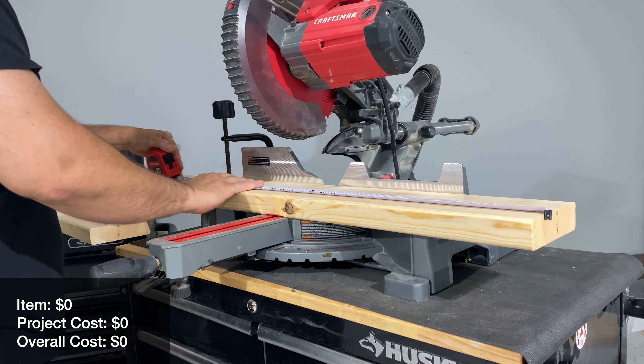To do this, you can just stack your two boards up, make sure they're lined up on the opposite end, and then line the shorter board up with the saw blade before you start cutting. This will put you in a position to remove any of the excess. After you've made all your cuts, you should have something like this. Also make sure to dispose of your scraps, put your stuff away, and then vacuum when you need to, because it'll save you time in the long run.